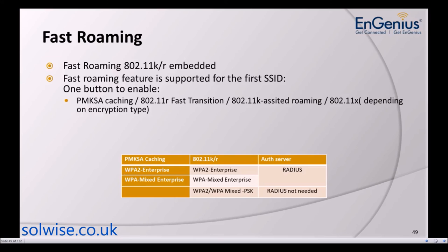So it's talking through its existing connection to negotiate, effectively through the LAN connection of the second access point, the security protocol required. That's called 802.11r, and again, that's after the client has decided to move and made a decision about which access point it wants to connect to. Then the R process steps in to streamline that security handshake, and that knocks it down from, I don't know, typically about 30 milliseconds down to about 10 milliseconds for that hop across.